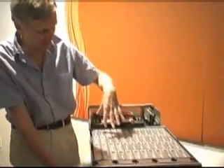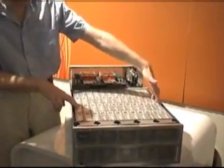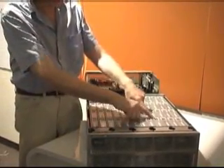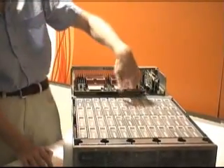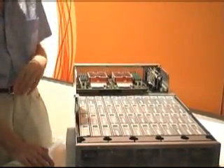The one question people keep asking is how this is cooled, because it looks like no air gets through here. The disks are only one inch wide, and we have 12 disks across, but the box is actually 16 inches wide — so that's 25% of the area available for airflow. Covered by airflow tunnels, the air goes between the disks, and the temperature increase from the front to the rear of the box is only 5 degrees centigrade, so we get very good cooling.